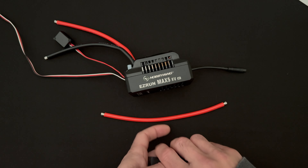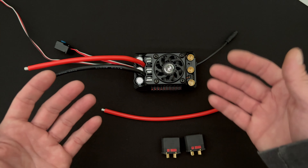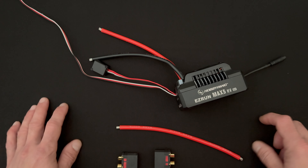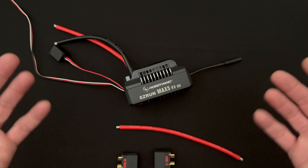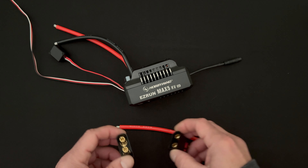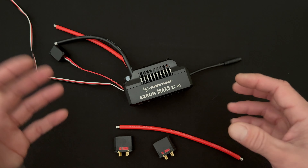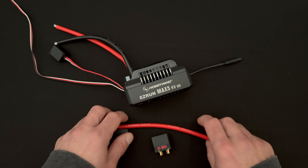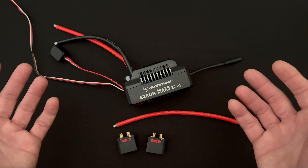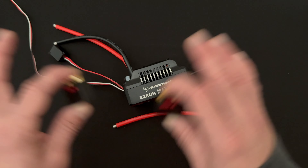Let's talk about dual battery pack versus single battery pack setups. If you're going to run multiple battery packs, that can be done on most speed controls - even a 4S speed control can be set up to run dual 2S battery packs in series. Series is more common these days: two 2-cell packs make a 4-cell, or two 3-cell packs make a 6-cell. Parallel increases capacity but isn't ultra safe with LiPos if they're unequal in charge or capacity. For series, batteries must be equal in capacity, performance, and life.